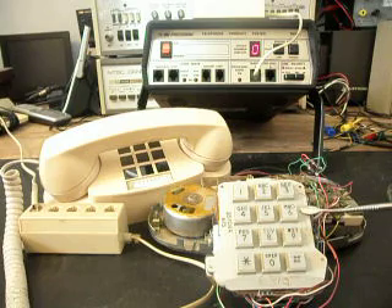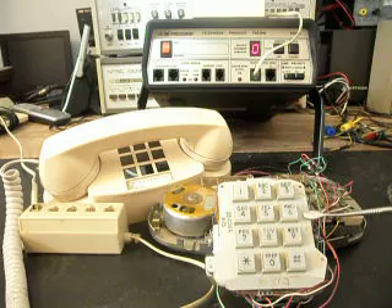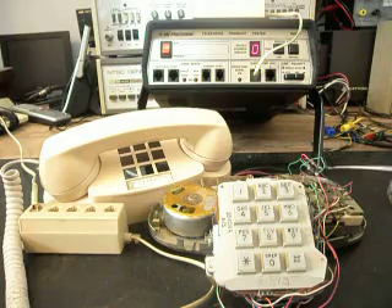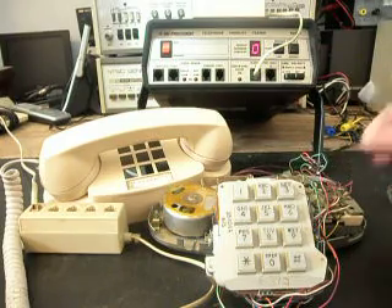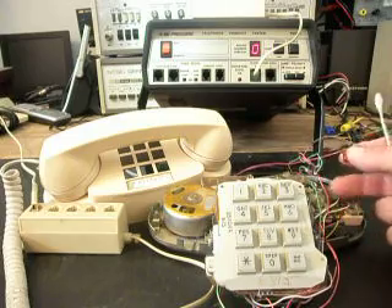The keypad was bad. What I do is rebuild keypads when I get a chance — I replace them with original keypads and then rebuild the bad ones later when I have more time. So this keypad has been changed out, and another thing we wanted to do was build a bridge rectifier circuit so that everything was protected.